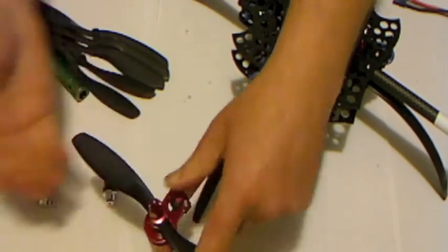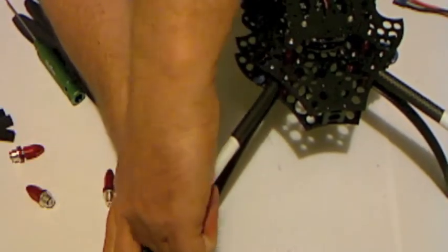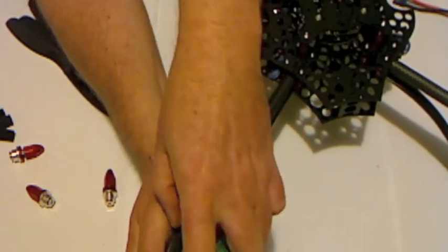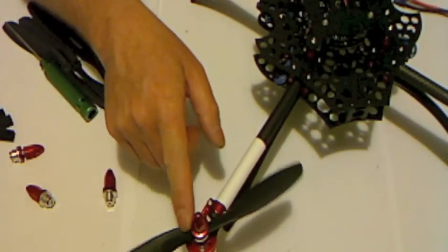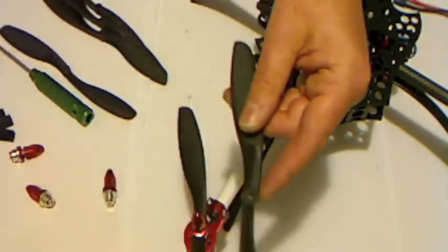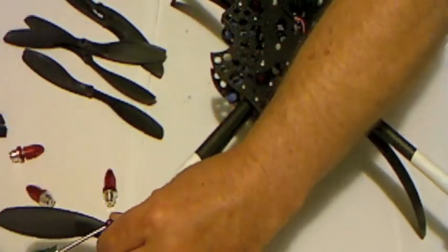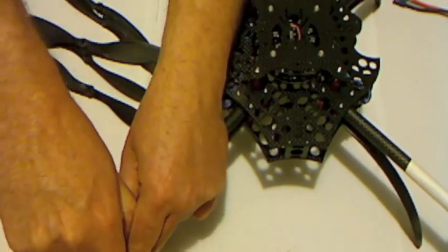It's a bit hard to see, but what I do is cup the motor with these three fingers really tight, then hold the prop and tighten it up. Finally I put a driver through and really crank it tight. Then give it a tug — it needs to be really, really firm. The last thing you want is one of these things coming off in flight. Now you have two different directions of prop: one spinning one way, the other spinning the opposite way. You need to make sure you map the prop to the motor direction as per the chart — but we still don't want our props on yet.